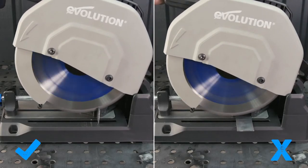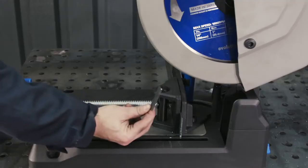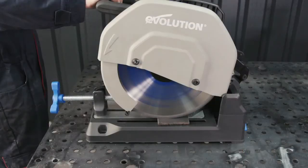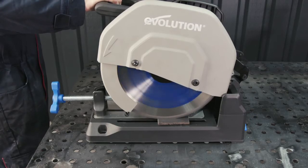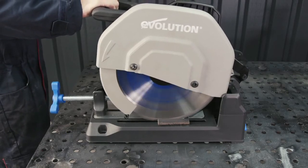For bar up to 80mm width, I recommend cutting in a vertical position to avoid cutting a large flat surface. However, for your 100mm lengths and larger, move the back fence to the furthest position back, so you're coming down at an angle to avoid cutting the entire width of the blade as you would in the central position.